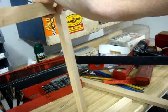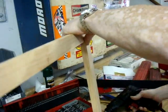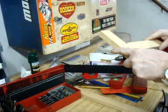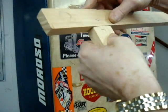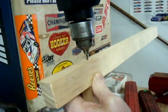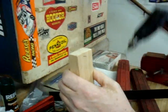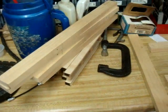We'll do the same thing on the other one, but first we've got to pre-drill these holes. We're going to start with number two because that's the one I picked up. We're going to line this up to the two lines that we made earlier and stand it up like that — hold it still. Then we're going to go into the hole that we pre-drilled and drill a smaller hole. That smaller hole will accept the threads of the screw. We'll take it a little bit deeper because we do not want to split the wood. All of this is so we don't split the wood. We're going to do that on all four of these, and then we'll set out the other side and do all four of those as well.